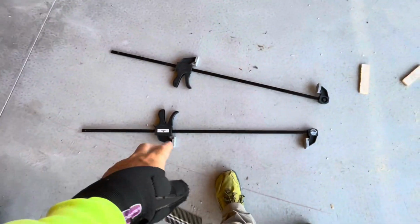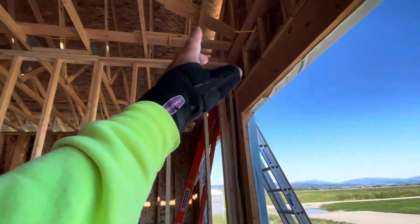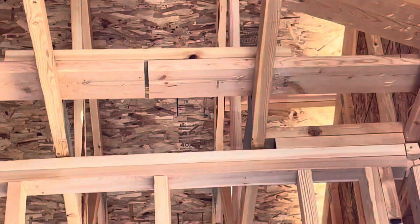A really good builder friend from Viking Construction here in the Valley came by. And he goes, let's just cut all your truss runs, your cords or your rat runs or whatever, 1.5 inches, zip, zip, zip. And then we used two, I happen to have these in the trailer. My good ones are in the storage unit, but these are just two cheap Harbor Freight clamps. And we just clamped the two trusses together.